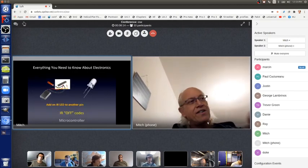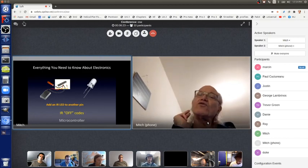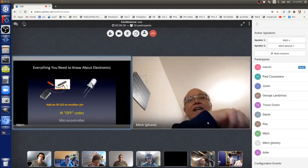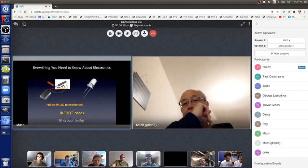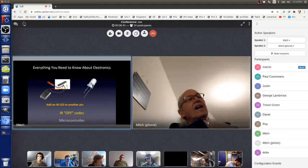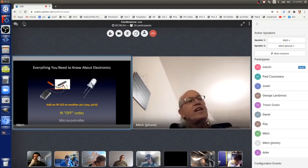And I'm not going to draw wires on the screen anymore. The pictures won't have all the wires because it gets kind of messy. But you can just imagine, rather than having just one output pin, we can have two. One is connected, as shown here, just like before with Hello World, to pin 13 to a red LED. And then another pin, let's use pin 3, is connected to an infrared LED to control blinking an infrared LED. And of course, it's an LED, so we want to ensure that no magic smoke goes away, so we put a resistor in series with it.